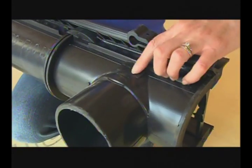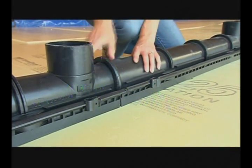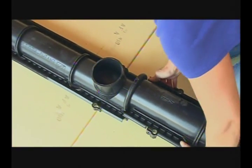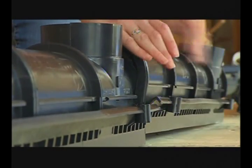The sections are numbered so you know exactly how to put them together. They've got a tongue-and-groove connection system, which is very easy to put together and makes a tight, uniform joint. It's always a good idea to dry-fit it first, and then use a sealant when you're putting it together for real.